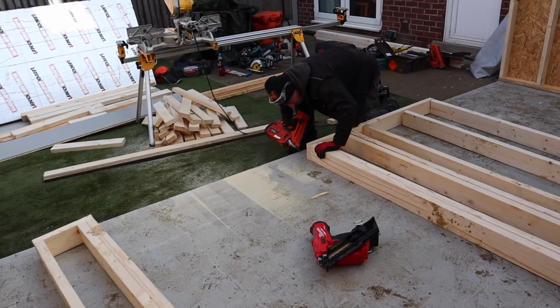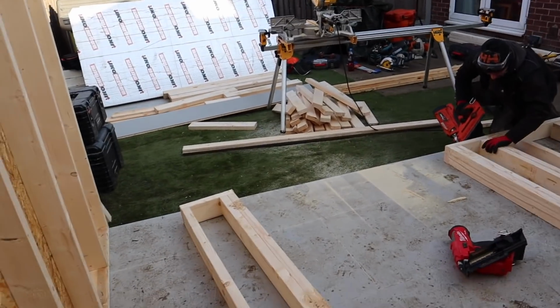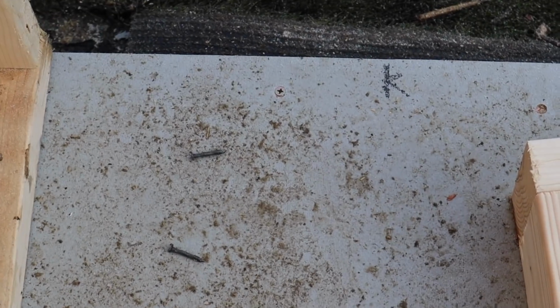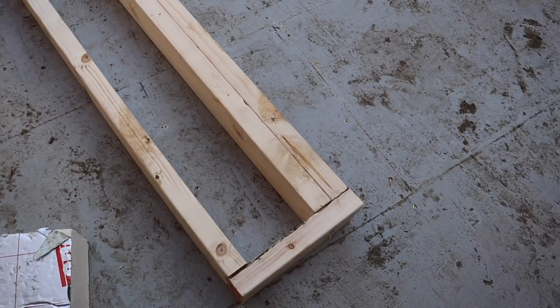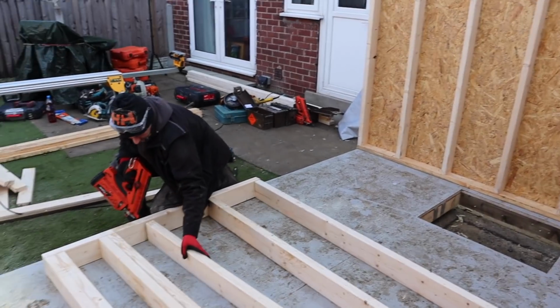Right, so what's happening now? This is the front wall obviously here, so we're going to have some 3 meter bifold. So over there, I don't know if you can see that, I've marked on the floor there. There we go. So that's that 300 mil wall there. We've put a double 5x2 in there. That's going to carry the steel. So we've got a double one at the front and a single one at the back. This wall here then again is for this side over there.